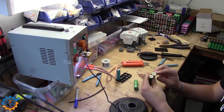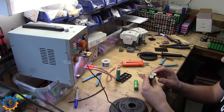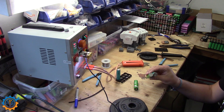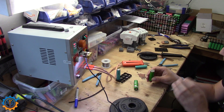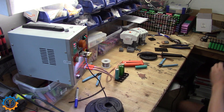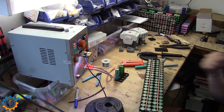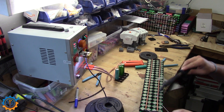On the right side is the cell that I used too much current on, and you have the burn marks, and then the wire will not function and you might even burn a hole in the cell. The current is in a very, very delicate position where you need to find where it works the best. I do recommend that you test this. Also note that I was only pulling one way in my test, and depending on the busbar wire that you are using, you may be pulling the other way when you have the finished pack. You might want to spot weld against the copper bar as well, but that won't work well at all. So I recommend that when you have spot welded everything, go back and do the soldering part to the busbar itself.